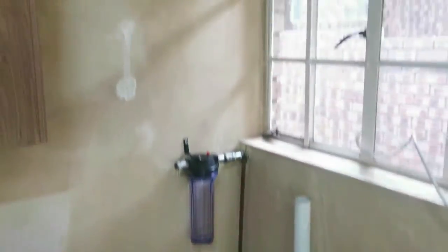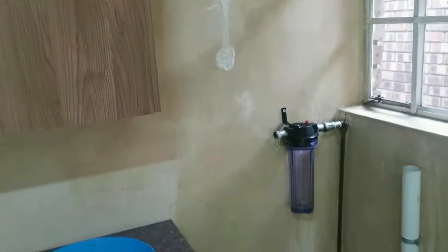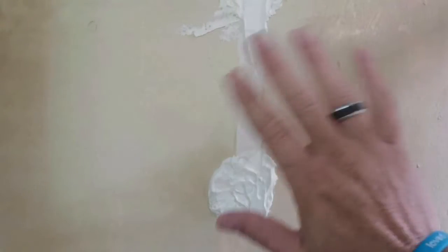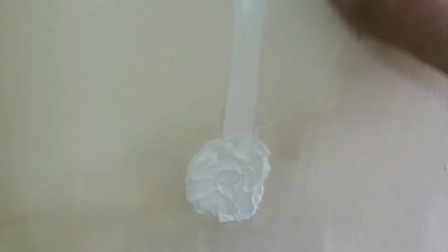After we've completed washing the walls and it's dry, we're going to go on to the next step which is polyfiller - just to do polyfiller all the places where there's holes and stuff. You'll see I've already started. I've taken off all the shelves. We're going to start getting the polyfiller off with a scraper or with sandpaper to make it nice and smooth. Luckily, polyfiller is very soft, so once it has dried you can take sandpaper and sand off all the excess polyfiller to make the surface nice and smooth.